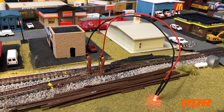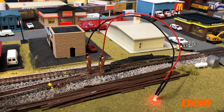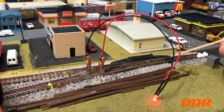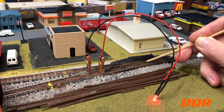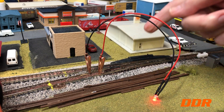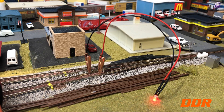Now we're going to try some DeOxit. I didn't even get the voltmeter out yet because I found it right away. Let's use the other end of this so it's making contact. I'm afraid that's going to be a problem — I don't think any amount of cleaning will fix it. It's just not making electrical contact underneath. They have a little shoe under there that rubs against that rail. I can try to flush it with alcohol and work it enough to get down in there.